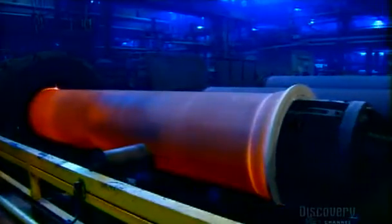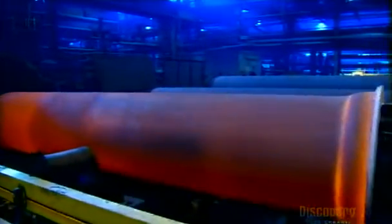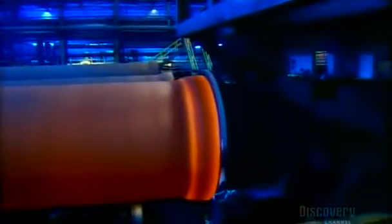After extracting the pipe, the factory weighs it and measures the wall thickness to ensure everything meets specifications. Then, on the bell end, they remove the core. It's made of sand and plastic resin, so it simply disintegrates.